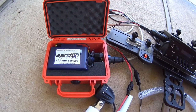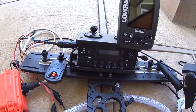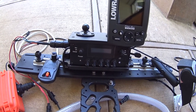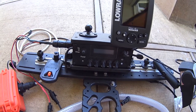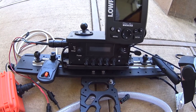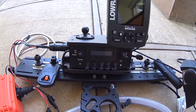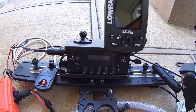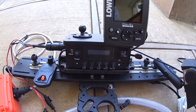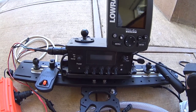The battery box then cables to a control box which I designed. The cable I have here is a test cable I use on the benchtop — the cable on the boat is quite a bit more extensive and difficult to see because it's routed underneath the gunnel. This test box has two purposes: one is to provide convenient switches and fuses for each of the circuits, and also some smarts to tell me how much battery is left. After I go through all the individual pieces I'll show you this box in action. The loads I have now besides the original fish finder are all the lighting necessary for running at night.